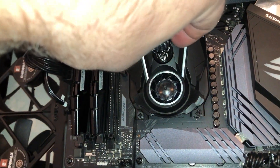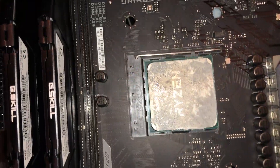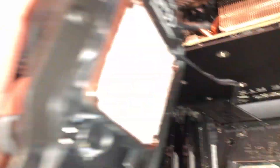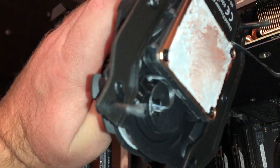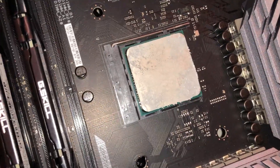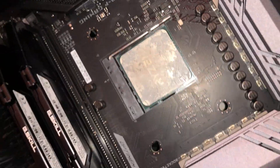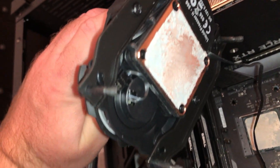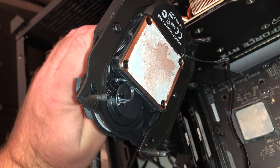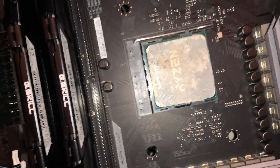First time coming off — let's see what we have. We'll lift it carefully straight up. Well, that's not bad at all. It's a little thin, but as far as coverage goes, we've got edge-to-edge contact. Same on the plate — just a little thin in the center, but I'm happy with that. I'm not expecting truly different results. If we saw blank spots or just a big circle that meant coverage didn't extend to the edges, then I'd expect to see a difference. But this looks pretty good. It could just be that the center of the die was a little domed, and we didn't need quite a thick contact patch there. But we do have spread all the way to all four sides of the die.